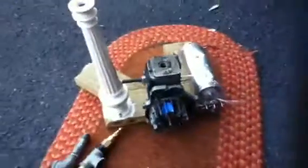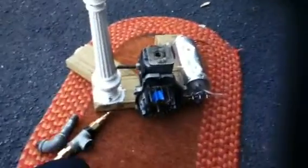Part 9 — it ran. It did turn all the way over. We could feel the air coming off. The key, if you don't have a flywheel, is playing around with your valve, plugging all the leaks, and you need a lot more pressure. Oil is also important, and it vibrates a lot. This is part 9 of the homemade steam engine — it runs. Now it's time to tweak it.